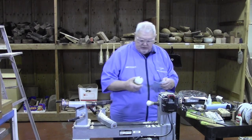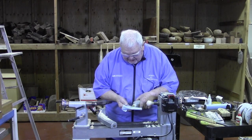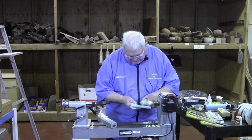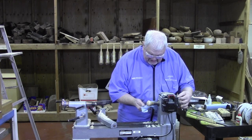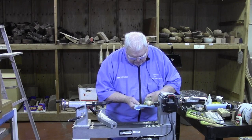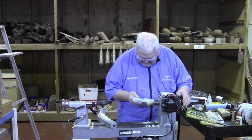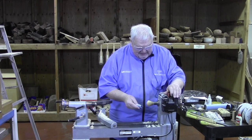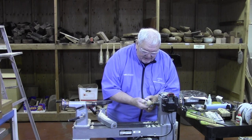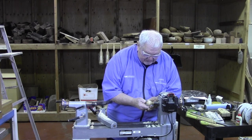So now finish — and what I've decided to use again is our walnut oil. It's a quick, easy finish. I can put this on with the lathe off. Work some in. Now the side grain will take up a certain amount but the end grain is going to take up more, so putting a little extra down here is a good idea. The walnut oil does not shine up bright, but I can burnish it until my fingers get warm — that will cause it not to be sticky when I pick it up later. I'm holding the dry paper towel against the wood waiting for a little heat to build up.